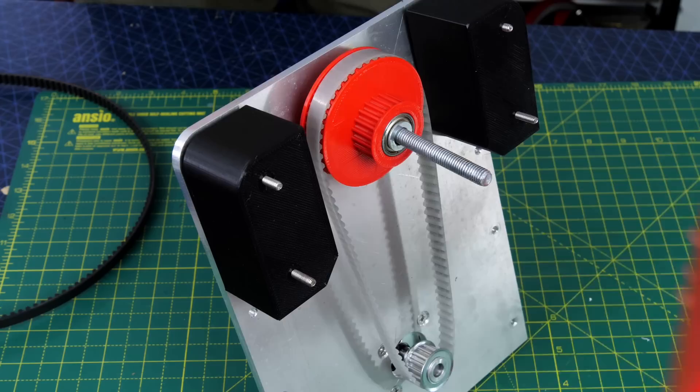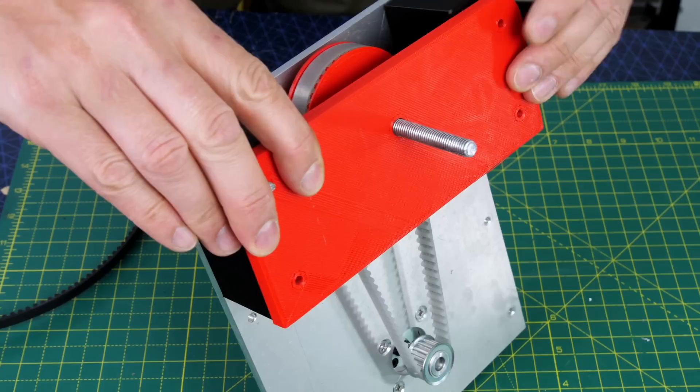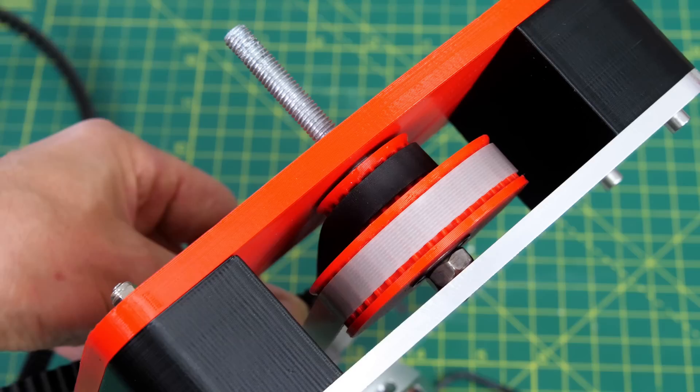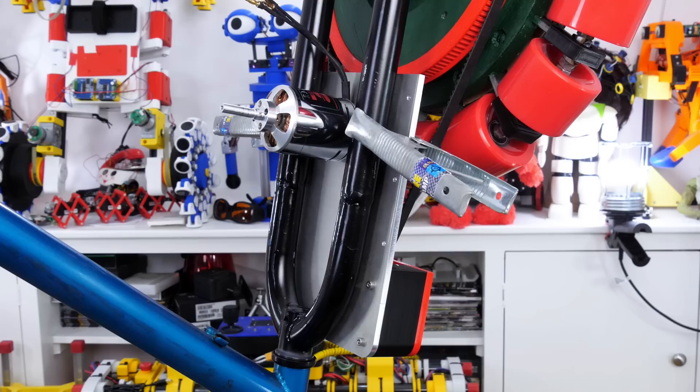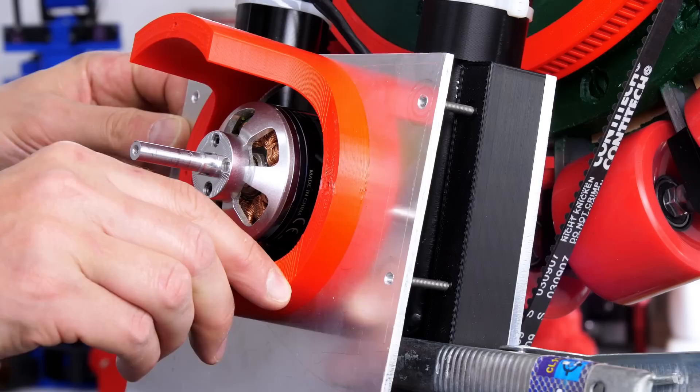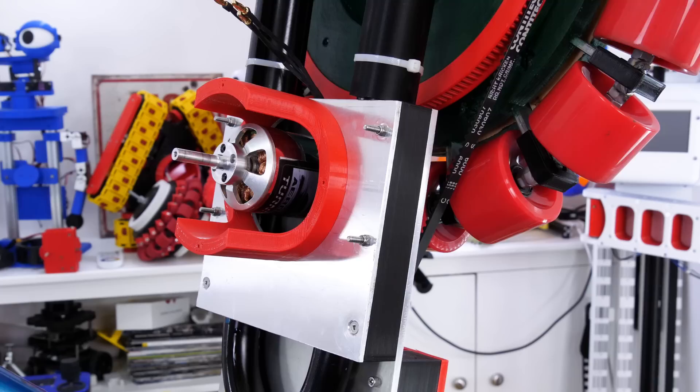I've got an intermediate 2-to-1 pulley which has got a T5 on one side and an HTD profile on the other side, and that's braced between the aluminium and another 3D print which will be more than strong enough. That's my big HTD profile belt and that's going to go round the wheel — the motor pulley goes up to that big pulley and the little one is going to go back down to the wheel. That assembly is attached to the front forks and there's going to be a 3D printed block either side with two bolts bolting it through and another aluminium plate on the back, which is also going to be the encoder mount for the motor.